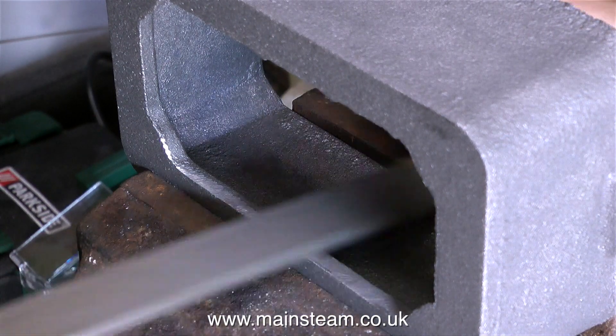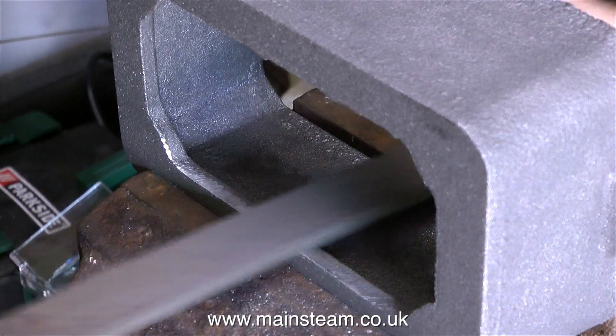You really have to be careful using an angle grinder - wear eye protection etc. - as this will very easily ruin the box bed, so be very very careful. But the good news is I didn't ruin the box bed; I just removed the high points of the flashings. Now I can file what's left - the hard chilled points are gone and the file is working well. With my trusty file I'm getting a good finish on the inside edge of the box bed.